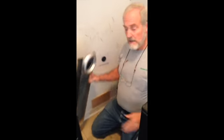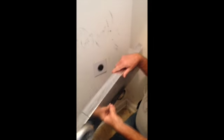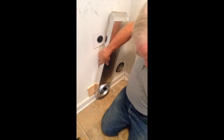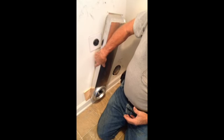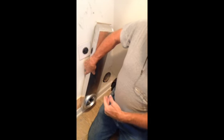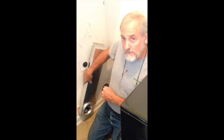The whole idea is to get this periscope right here cut down to length, positioned on the wall to receive the dryer. I'm going to go ahead and cut this down, tape it up, tape the seam, and we'll come back and slide it in. I'll show you the finished product.